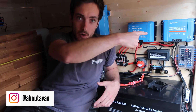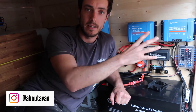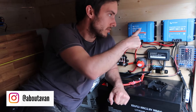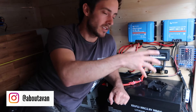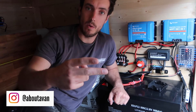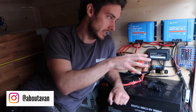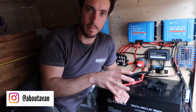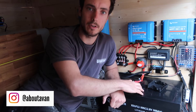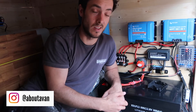Up in the top left corner we've got an MPPT solar charge controller. This is Bluetooth enabled — most Victron stuff is Bluetooth or 'smart' as they name it. That's good for two reasons: you can view it on your phone, and it can network so components can talk to each other, helping to manage and balance the system for efficiency and battery longevity.